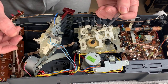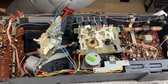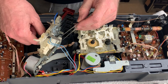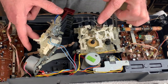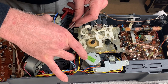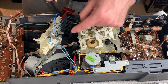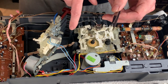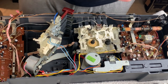Ideally we'd want to turn this all over and get this out, but in my experience with these Sanyo units of this era, the brass bush and everything else - once that's out you can't really get it back in properly, and you end up snarling up different cogs in the mechanism. So this is supposed to be a quick and easy video - we're just going to clean this up. I'll get some decent paper shop towel and some IPA, clean that up, and by the looks of it there's no reason why this won't be the same size belt as that one.